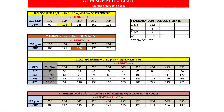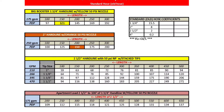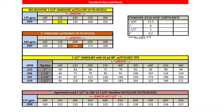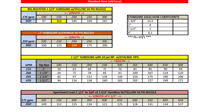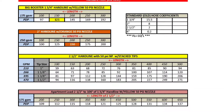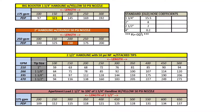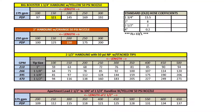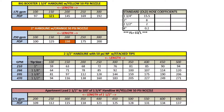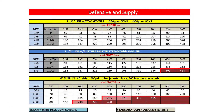At the very top of our offensive pump chart, we have our big booster inch-and-three-quarter with various lengths and the pump discharge pressures that coincide with those lengths. Underneath that is our 2-inch line with various lengths and pump discharge pressures. Then we transition to the 2½-inch line. Keep in mind this pump chart is designated for offensive fire tactics, with all nozzle pressures set for 50 PSI hand pressure. We also have an apartment load: 100 feet of inch-and-three-quarter hand line with our yellow 175 GPM nozzles, with the various lengths of 2½-inch hose pre-connected.